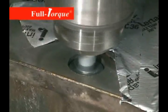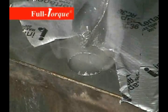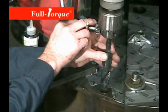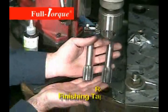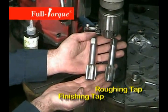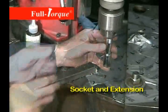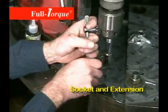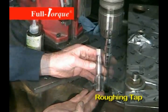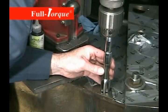The original design of the Z sleeve is to use O-rings and sealers to keep water from leaking underneath the Z sleeve into the head bolt hole, and then it climbs up the head bolt hole and gets into the oil. But with the insert installed, that can't happen. So not only is this a good repair for the blowout in the bottom of the hole, but it's also a good way to repair the Z sleeves, make them stronger, give them more support, and seal the bolt hole from the water.